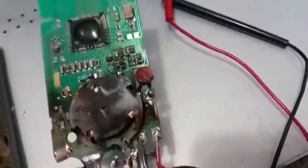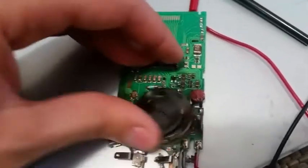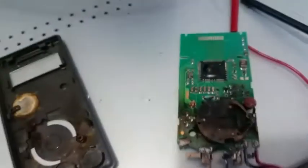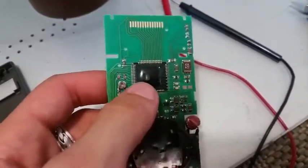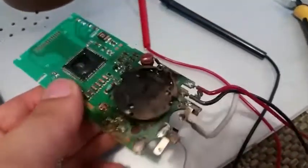The wire. Oh no, it's not a wire, it's one of these soft contact things that goes up here. Yes, there is not so much safety on this circuit board. Just a MOV. I'm surprised that it even got one. And yes, the MOV actually took some power. And this switch, which is not a switch anymore, I don't know what to call it. The chips look pretty intact, just that it got a little hole in it, where the magic smoke escaped. But yeah, not so much else done to it. It actually blew itself apart.